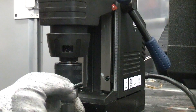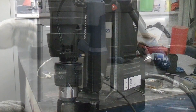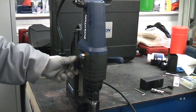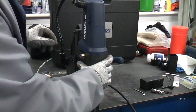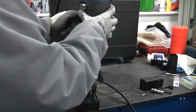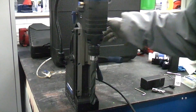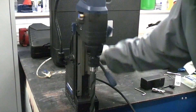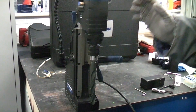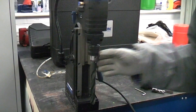I'll put a large drill bit in the chuck — this is a blacksmith's drill, or reduced shank drill. You will notice that if you lift the handles up fully, the drill bit will not go high enough. So what you need to do is get this lever, undo it — it has a left-handed thread — pull the machine up high enough, and then lock it back in position. That means you can use virtually any length of drill bit very easily. I have used some mag drills in the past and struggled to get the height needed, so that is a very useful feature on this machine.